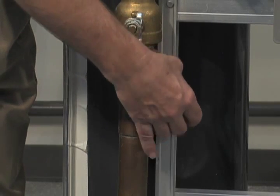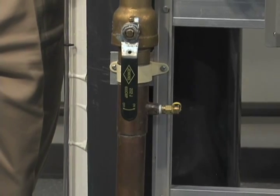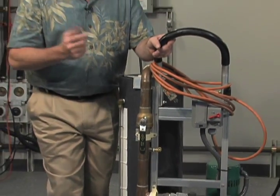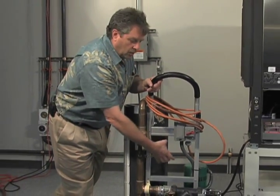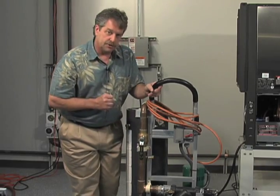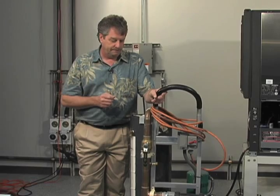Please don't hard pipe a pressure gauge here, because typically when you're moving around in and out of vehicles, up and down stairs, it could easily get broken off. So it's best if you use a gauge with a probe so that you can remove it, put this cap on. Now you have very minimal exposure for any kind of mishaps on the site or transporting to and from.